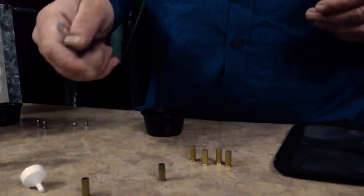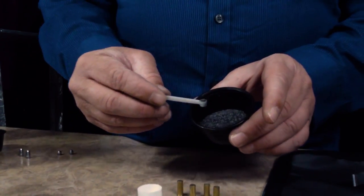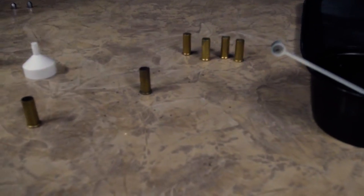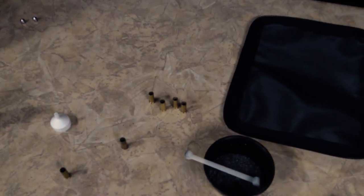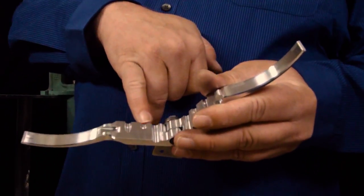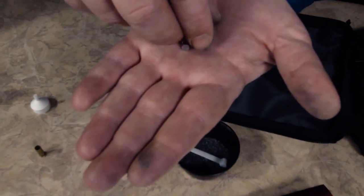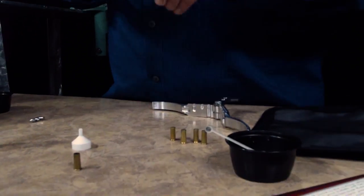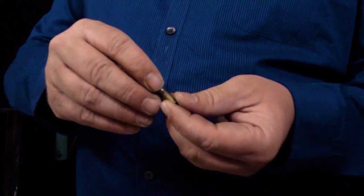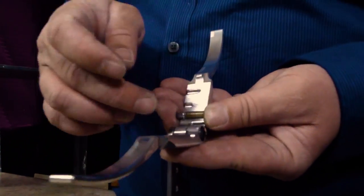This case from earlier is already dry. Powder funnel goes right there — I've got my small end and my large end. We've got our powder in there. Now the biggest part of our .22 Reloader is this right here: our bullet molds. You pour lead in here, open it up, and we've got a 38-grain bullet mold, a .25, and our crimping tool built in. I've already gone out and cast some bullets. Taking a 38-grain bullet, put it right in the case — slides right in there, stops at the heel.